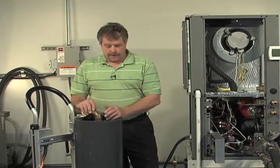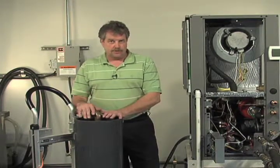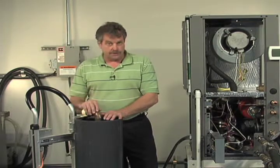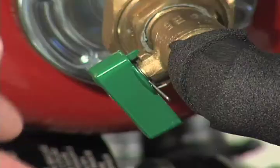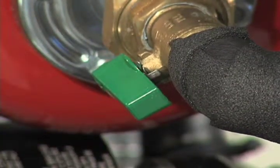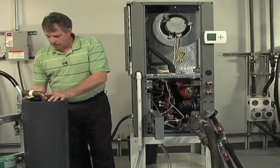We're getting ready to go ahead and pressurize the system. Again, this is a video that's covering a pressurization loop. We're going to have some others down the path here about some non-pressurized. But one of the steps you don't want to miss, guys, is we now have an expansion tank in here. You want to make sure you open up that valve. We're going to go ahead and apply our deadheading pressure with the flush cart pump.